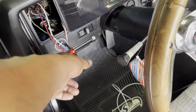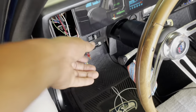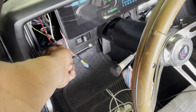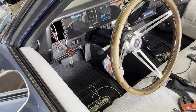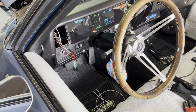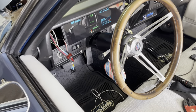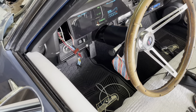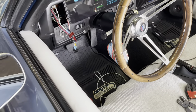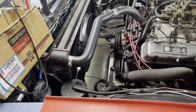Let me go ahead and turn it off. The switch isn't hot, so that's good. What I might do is buy a 30-amp-rated switch just in case — since I already bought this one and cut it open, I'll probably just keep that as a backup. Now it's just going to be final installation.